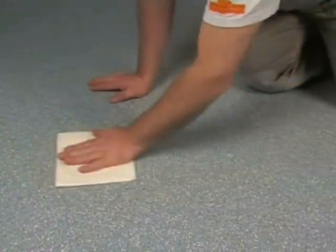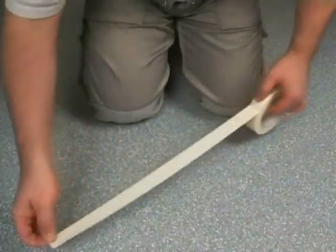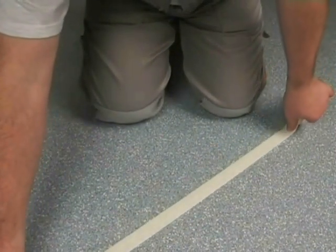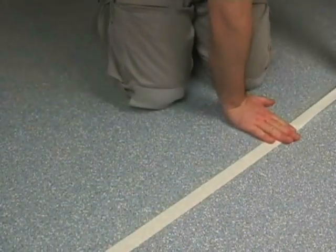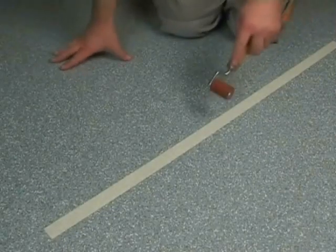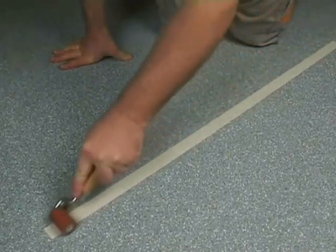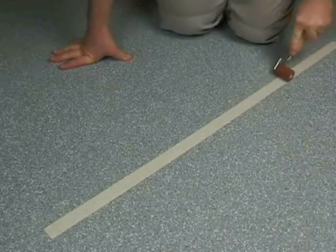A seam ruler is very helpful. The seam area must be clean and dry for the adhesive to function. Masking tape that is resistant to the cold welding liquid has to be centered evenly over the closely cut seam. It is absolutely vital to avoid damage to the outer floor finish coating. Apply the masking tape tightly by using a seam roller. This is to prevent the liquid from penetrating underneath the tape.